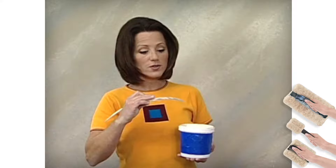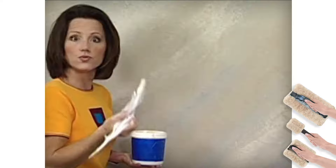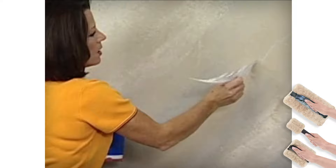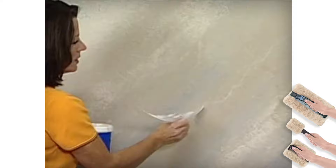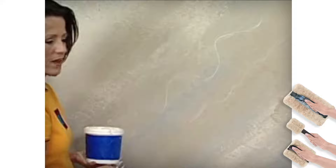We're ready now to do the marble veining using the marble veining feather, which is basically a turkey feather. We've got this whole big feather but the only part we're actually going to use is the very tip. I'm going to dip it into my paint-water mixture, wipe off the excess, and use the tip of the feather to basically draw a marble vein on the wall. One thing you do want to do is jag it to create the line — a common mistake is people just pull it and make what I call the shoelace effect. You don't want that type of effect.